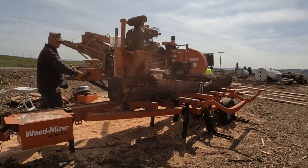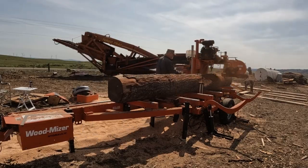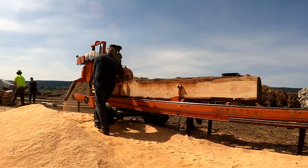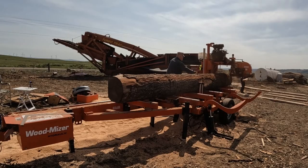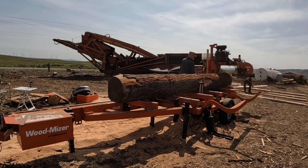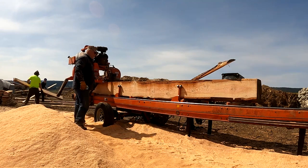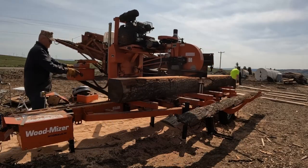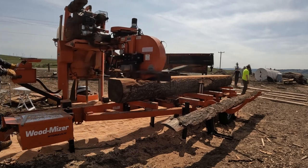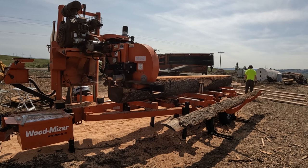We're not even 4 minutes into this video and I'm getting down towards the cant. I think in a previous video I said something about a minute or a minute and a half to a cant. I have done that, but actually you're more like about 3 minutes on an 8 foot cant. Big 16 plus footers though, it's gonna take you a little longer, but there we go. I'm gonna take a 2 inch cut out of this guy here, live edge. We'll come back and edge it later. It'll be a 2 by 12.